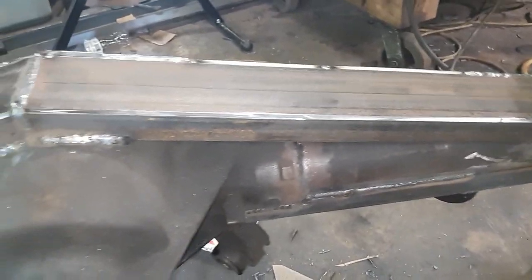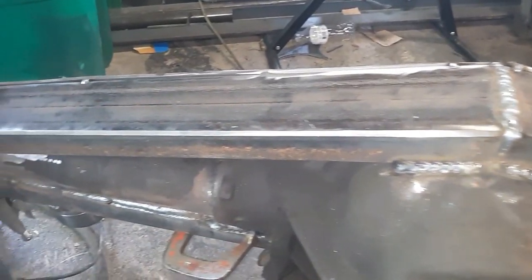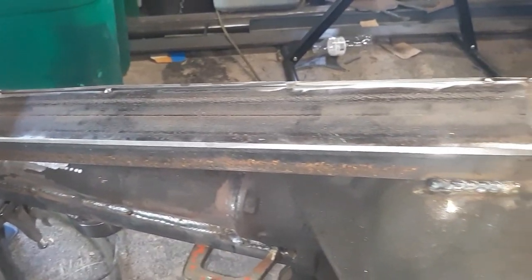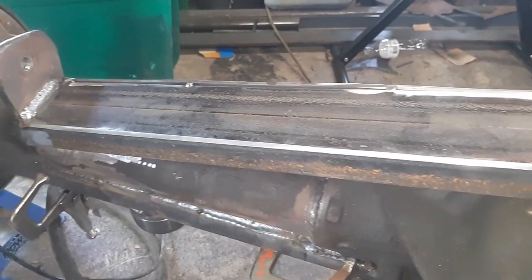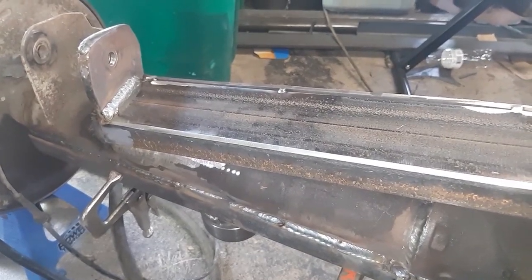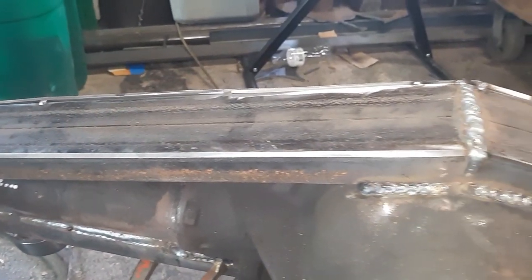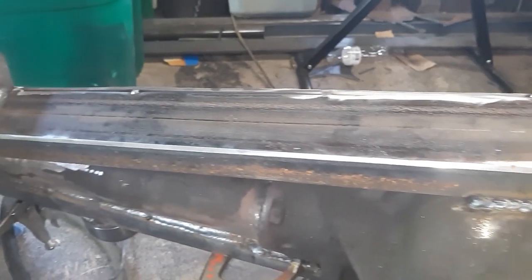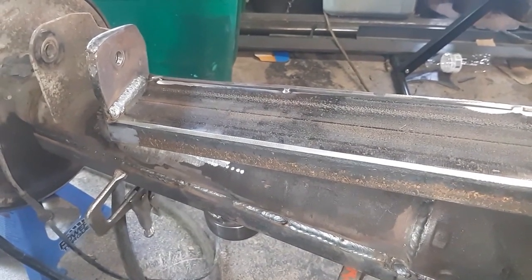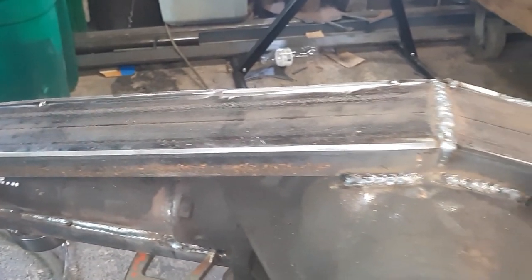And another thing I like about using the channel is if you don't make your cut perfectly fine on your reinforcement plate, you got the channel to act as a guide. As you can see there, mine wasn't just right here. My template fit pretty good, but something got messed up from there to the metal. So that was hanging over a little bit. So I just used my grinder with a flat wheel, smoothed it down to where my channel's at. I'm going to buff all the welds smooth anyways, so there's going to be some grind marks on it. But it gives you a level playing field to work with. So that's kind of nice.